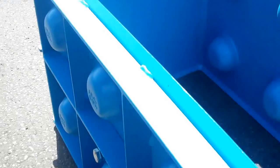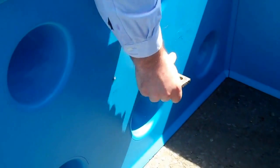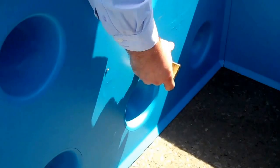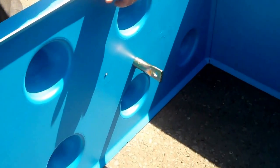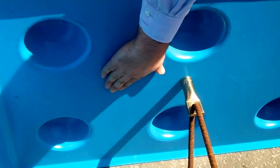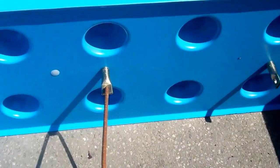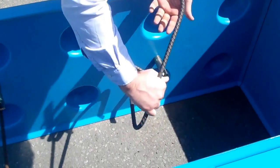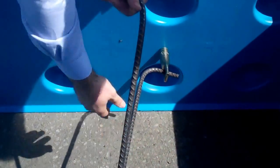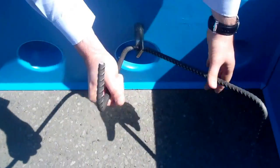So as I put the bolt in, it's as simple as this — this is the lifting eye. The plastic insert has already been inserted into this hole, and that's to ensure that the concrete doesn't come out of the hole. Now the rebar, which literally slots in like so.